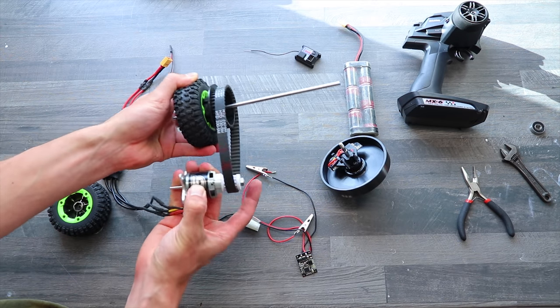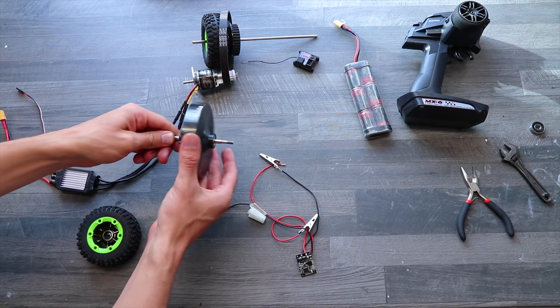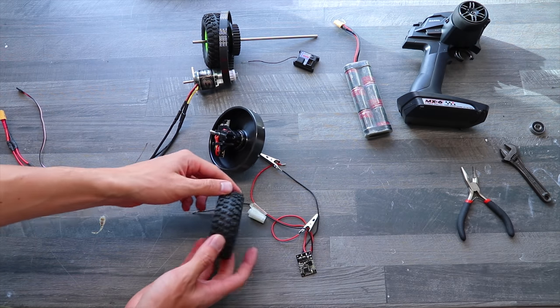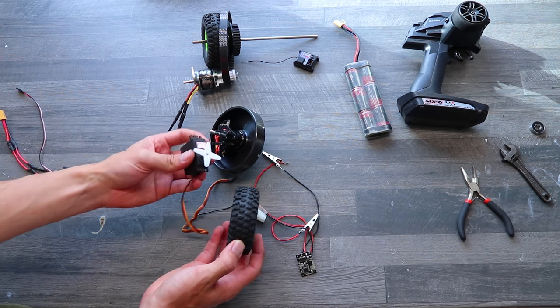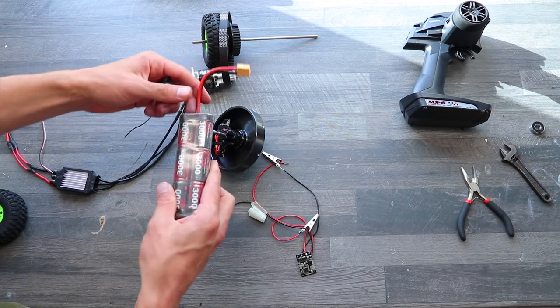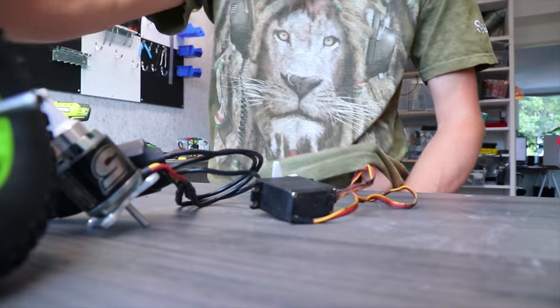And that's our drivetrain. Let's put the back tire somewhere here. I think the gyroscope will have to be somewhere in the middle, and then we'll have a front wheel that is connected to something like this servo so we can move left and right. Then we'll make some kind of top compartment where we'll keep the battery and receiver and everything else.